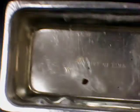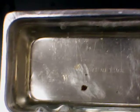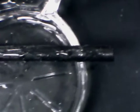I think a very thin piece of paper or dialysis tubing around that electrode will insulate it very well from the aluminum casing. When the water evaporates you get a very hard coating, which I don't necessarily want — but when I substitute propylene glycol for water, I think that gel is going to permanently remain a gel. Then I'll be able to coat that electrode, put a couple of washers around it, and center it in an aluminum case which will have the gel electrolyte.